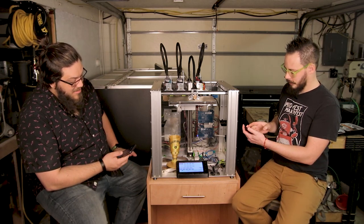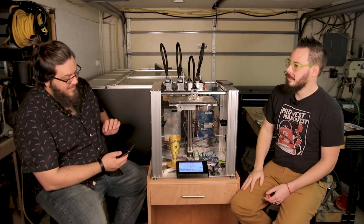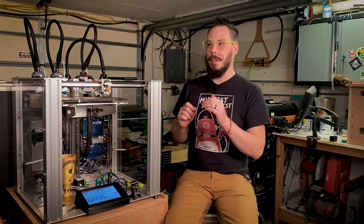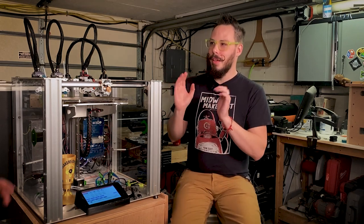Can you have extruders with wildly different Z offsets on the same system? For example, the standard V6 and a Super Volcano? Absolutely, because of what we just said. The G10 can be anything, and it becomes active as soon as the tool is picked up. Remember earlier we talked about the tool scripts, the pre and then the post. Pre, post, and free.